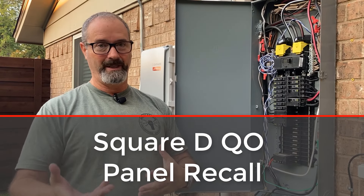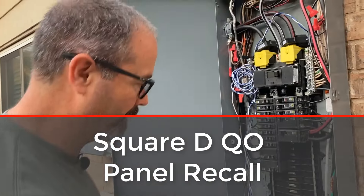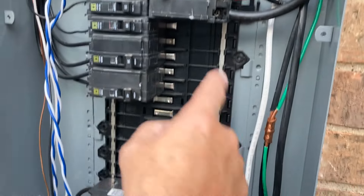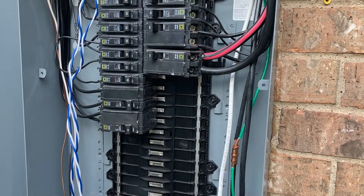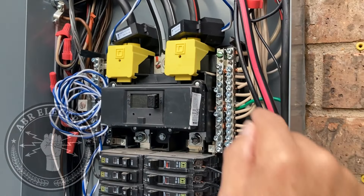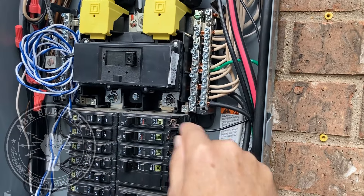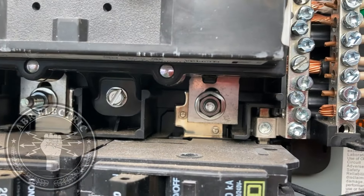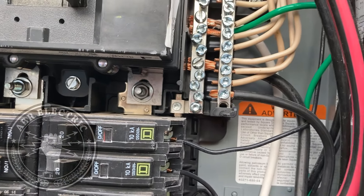Here's the nitty gritty on the detail. Bottom line on the plug-on neutral panel — coming in a little closer. So the plug-on neutral panels have this bus right here, and that's for the plug-on breakers, arc faults, those kinds of things. The recall is about these two screws right here — this screw and that little star screw right there. That's it. On the plug-on neutral, apparently in a couple of panels those were loose and got hot.